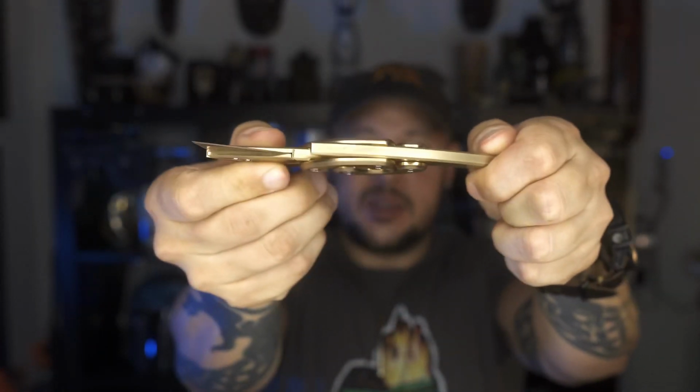And when the knife pivots, as these pieces move, if this is the knife and this is the washer, it's making a bearing, and you have some kind of grease or actual bearings, and you want it to be smooth. If you kink that washer, now you have these 2 high points that are kind of like ice skating across the surface of whatever they're touching. In the history of knives, I don't think anybody has ever recommended kinked washers, and it's filling the gap so that you don't have as much clearance.